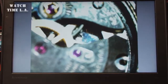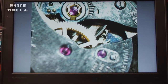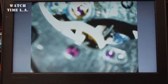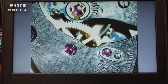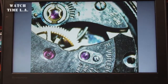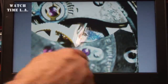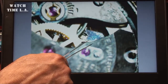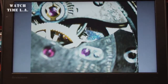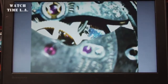You can see the spring here — the little hair spring right there. And you can kind of see the pinion of that going back and forth. What's really cool about this particular watch — that doesn't happen on a lot of watches when you take them apart like this — is way down there you can actually see the escapement going back and forth. This is the escapement wheel, and this is the actual escapement. The big gear you see turning around is driving the second hand — it goes completely through the watch into a tube that comes out the front, and the second hand is friction fit onto that tube. The escapement is what stops this from spinning continuously, and that is how it goes one second at a time. If this wasn't here, the watch would just unwind continuously at a very fast pace. This escapement, which is putting the brakes on this wheel, is what's regulating the time.